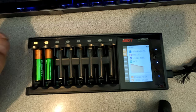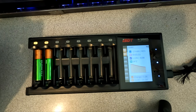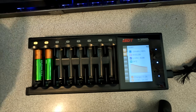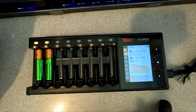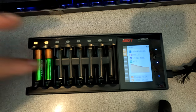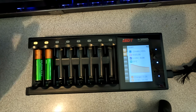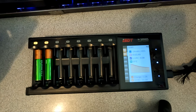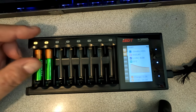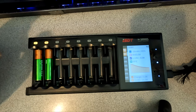I got some big numbers out of these batteries. My double-A's were rated at 2,400 to 2,500 milliamp hours, but I'm reading like 2,700 on some and 2,800 on others — so this thing does a really nice job charging. It also monitors the temperature. I charged a number of cells because I've got my little shortwave ham radio rig and I wanted a battery pack that's solar powered with rechargeable cells. I know a lot of people use LiPo batteries, but if I ever travel somewhere, they don't like those kinds of batteries. Nickel metal hydride is a safer battery, and that's what I'm going with.